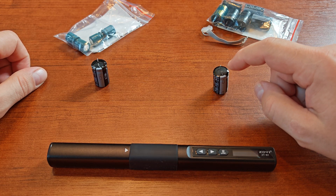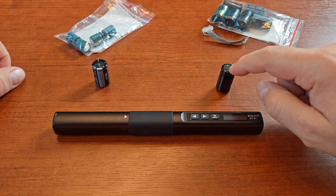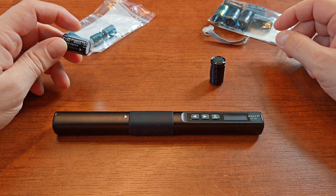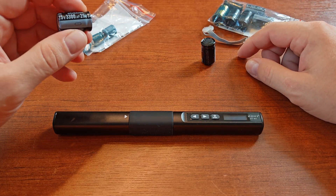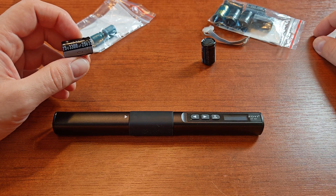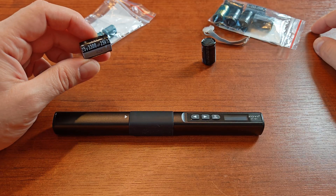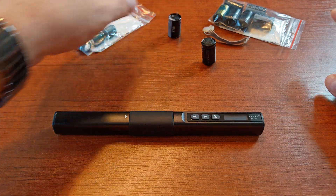I also thought that I'd do a quick video on the USB powered soldering tool that I used. Here you can see the cap that was the most bulged — that's the guy. I tried measuring them and they measure differently. This one is obviously damaged so it doesn't measure at all. Some are measuring as 4000 microfarads, some as 3 microfarads, and a couple are actually measuring quite close to 3300 — something like 3400, which is within the 10% tolerance limit. But this video is about the soldering tool.